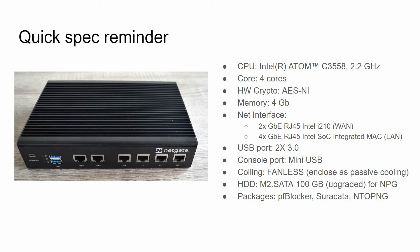The LAN ports belong to IX0 through IX3. For USB we have 2x USB 3.0 ports and a console port with mini USB, mainly used when initially setting up pfSense with PuTTY. What's awesome about this box is that it's fanless — no noise — with relatively powerful hardware. For storage, there's an M.2 SATA (not NVMe) with 100 GB.